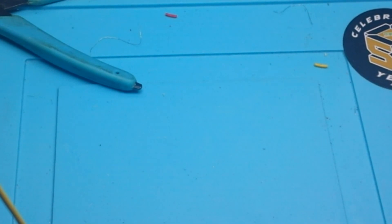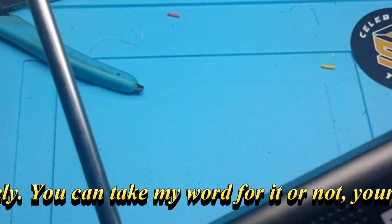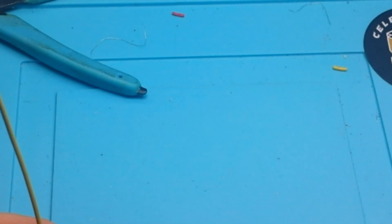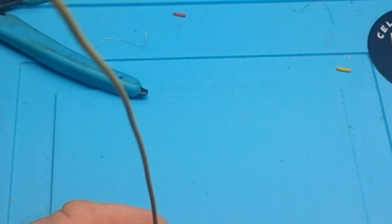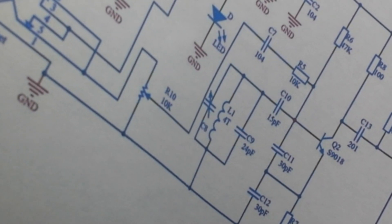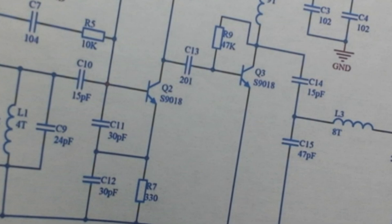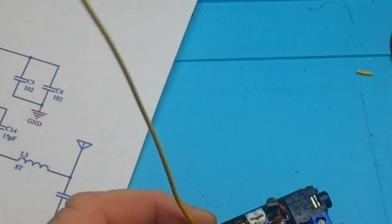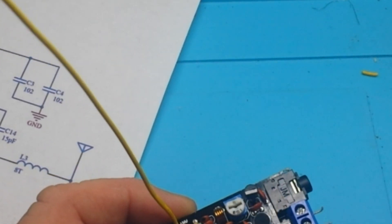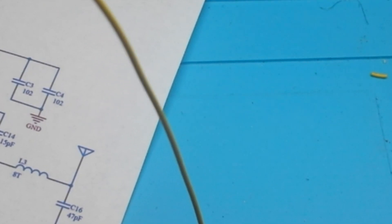We are kicking it at around 100 megahertz. We bring in the radio — testing one two, one two, one two — you can hear it, it gets in there. So it works! It's not ideal because going from the drawing I had to fudge a couple things — I didn't have any 47 picofarads for the final stage so I had to substitute with 22s — but it's good enough for a first draft. If you guys are interested we'll work on this for part two. Let me know what you think, give me a thumbs up, comment, share, and don't forget to subscribe. Big thanks to PCBWay and thanks to you guys for watching.